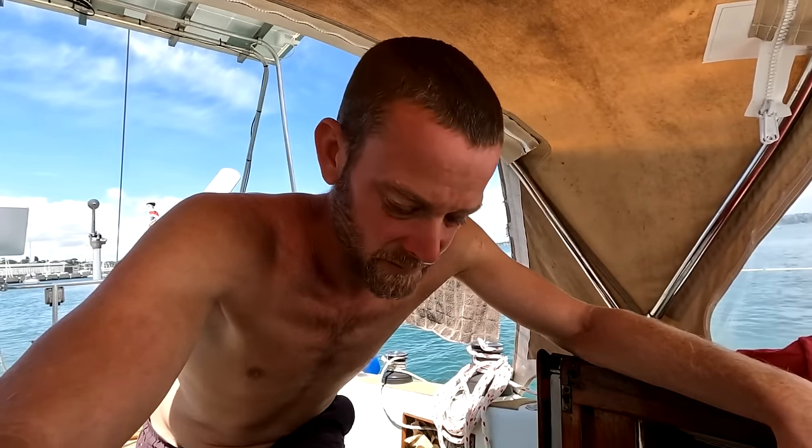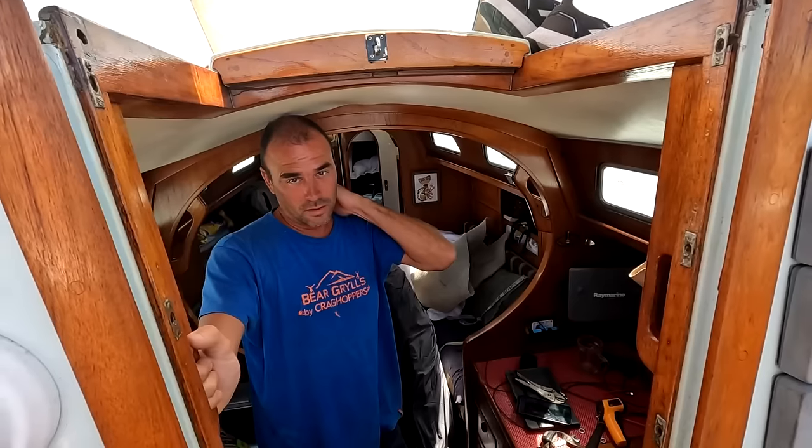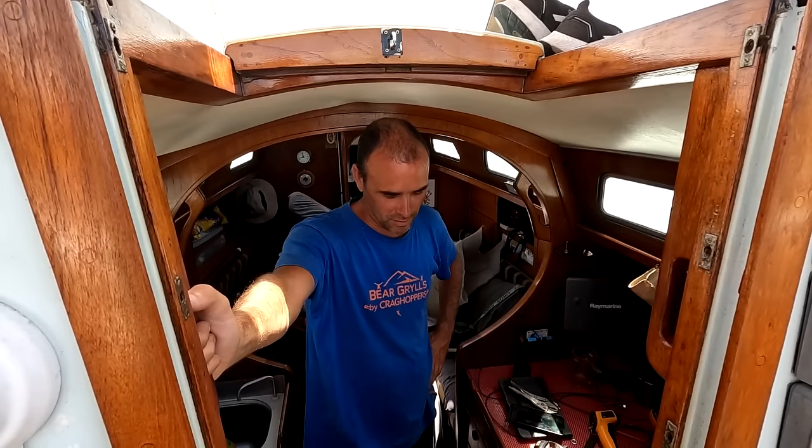So it is working, charging the batteries. Just got to keep a very close eye now on that new cable we put on. Make sure it doesn't start heating up. I tested it. I don't smile yet. I think it's working and I'm really pleased. Good job. I'll keep an eye on that cable, the heat on the cable. Yeah, well, it's not heating at the moment. The alternator's 60 degrees and the cable's 30.